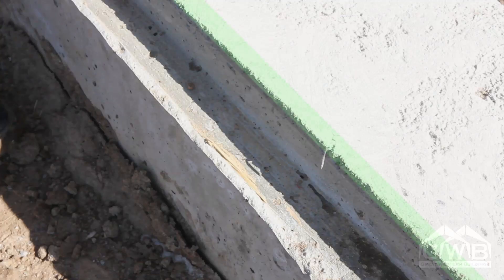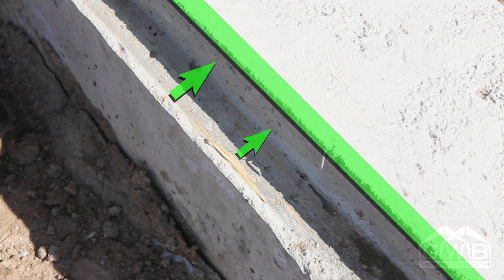If you are using a sheeting notch, remember that the foundation will be oversized by three inches in both width and length, or one and a half inches on each wall. I'll go over the sheeting notch in more detail when we do our foundation video later. But right now I bring it up because all the measurements should be taken from the top edge of the notch, which we call the steel line.